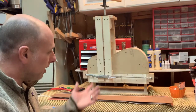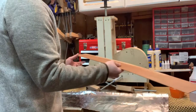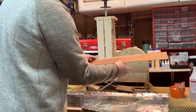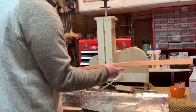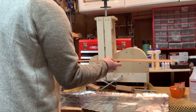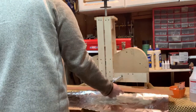It's imperative to position the side correctly when you put it into the waist. You want to make sure you're bending correctly because this is book-matched to the other side. I want to make sure the book match is lined up properly, so I have my lines marked out and I know exactly where to put it — not backwards or flipped over.